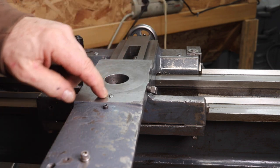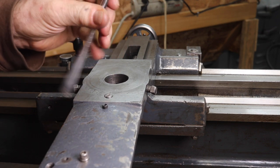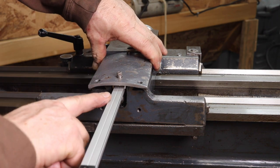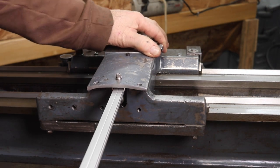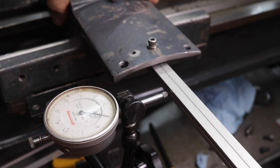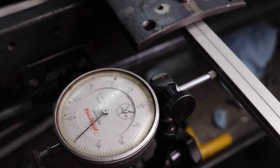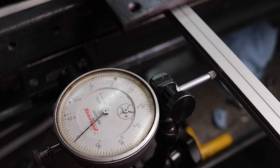I'll take off the nut to make alignment easier — less screwing in and out. With the feed nut disengaged it just slides on, then I'll adjust the gibs a little bit. I have a dial indicator set up on here and you can see how much it's running out. After a few minutes of back and forth, we're pretty good — only a couple thousandths in about five or six inches, so I'm going to call that good.